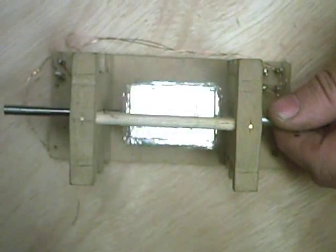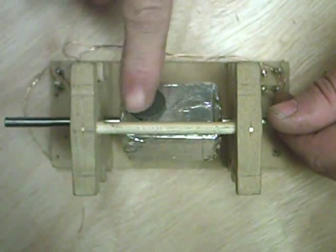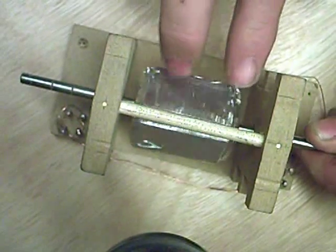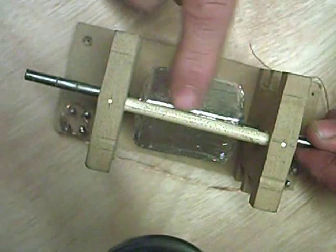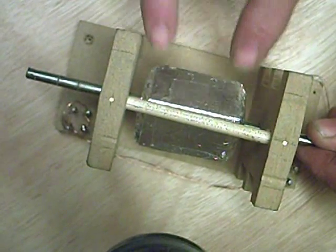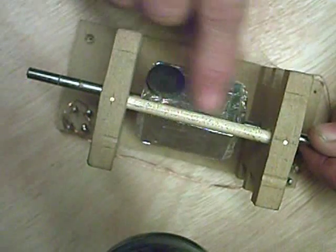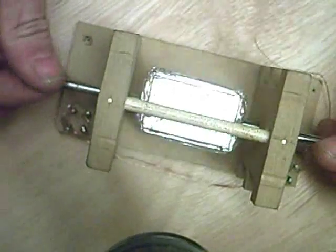This has actually just got neodymium versions of these inside there. It's got two — one there and one there. We've got two neodymium magnets on each face. That's two, four, six, eight magnets. We've got a metal plate over those magnets, under this foil, which helps to spread the magnetic field and make it behave as though it's one large square magnet. I hope that makes sense.